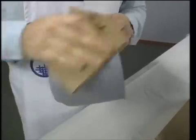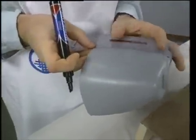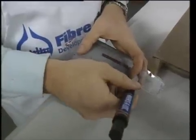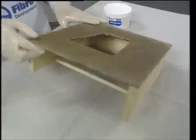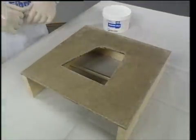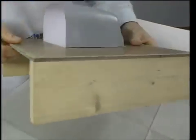After all four coats of wax have been applied, the plug is ready to be mounted in the parting board. Dennis draws the center line on the plug with a magic marker so he can visually verify that the plug is resting properly. He has also built braces for the plug so that it rests at exactly the center line. Now exactly half of the plug is exposed, which is necessary for construction of the mold.